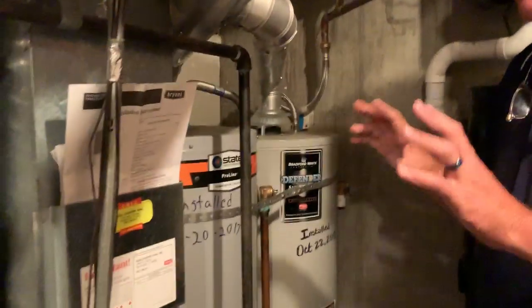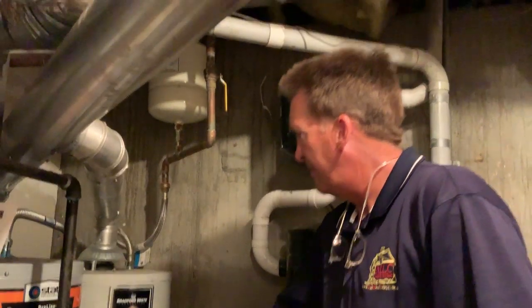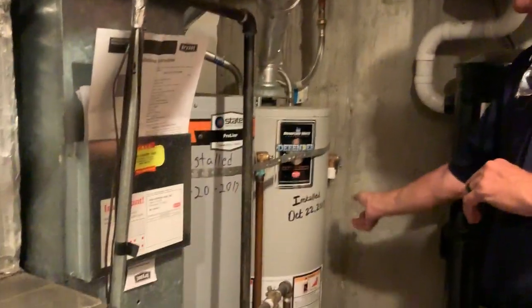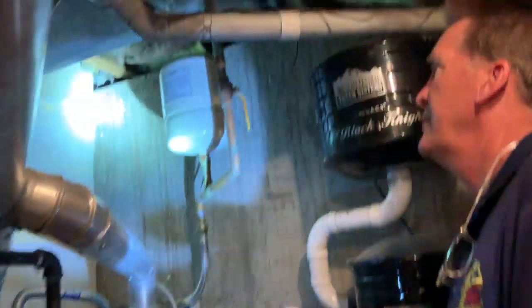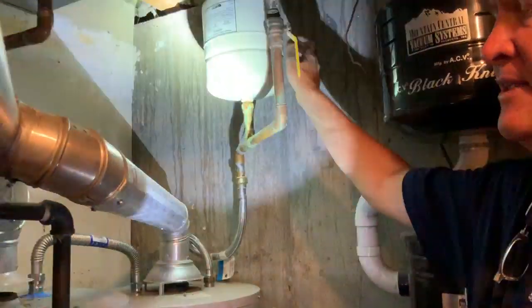Over here on our water heaters, the installation is fair at best. They've used plumber's tape as seismic strapping — it isn't sufficient. They're missing a drain pipe over here. They were done at different times: this one is 2017, this one is 2013. They upgraded this flue here when you have to go with a bigger flue, and this one still has the smaller. They do have an expansion tank up here that leaked real badly at one time. You'll see the rustic connection there where they upgraded the expansion tank.